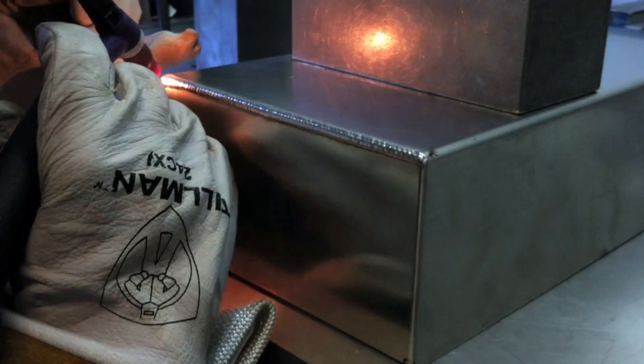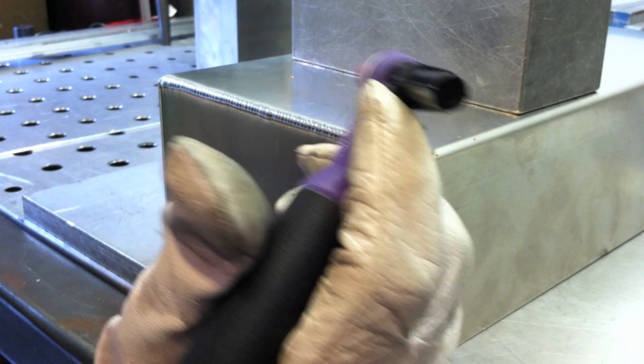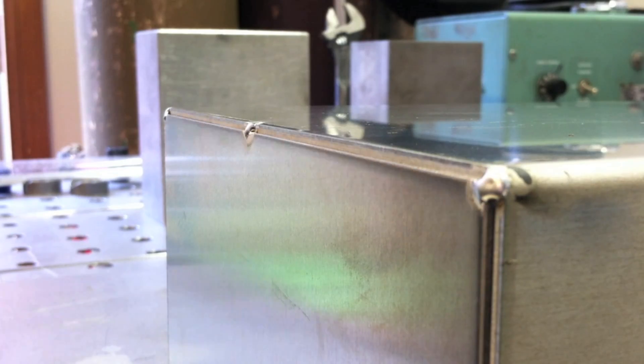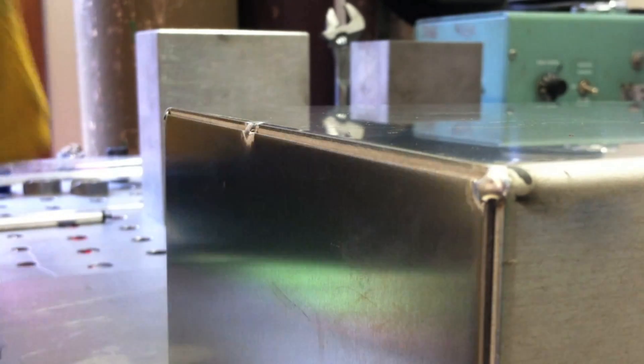You can hear the pitch change in the arc — I've dropped down to 60 Hz on a plain Lincoln TIG 175 square wave with no frequency adjustment. The pitch picks back up with Roy welding with the inverter. We're both using a number five cup; I'm using a pyrex cup so you can see it a little better. A regular number five cup doesn't require much gas — sometimes 10 to 12 CFH is enough, which matters when you're paying for your own gas.